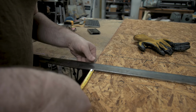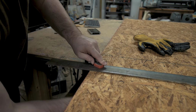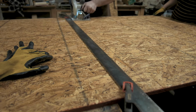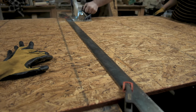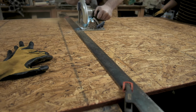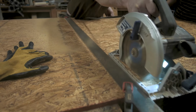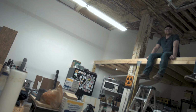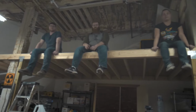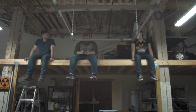Again, nothing in this building is straight or square or plumb or level. So we just kind of guessed. Well, we made it work. We made it straight. The way it ended up working for most of it was convoluted. Once we got the joists in on either side of the columns, everything is 16 on center, so you measure in the right amount, and we made a jig for that. You measure on the wall and on the header on the other end, from the right point to the right point, and that was the approximate measurement.